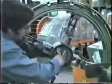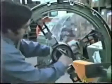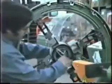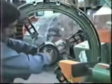The stator, now in our winding department, is having new slot insulation inserted. Before this, the winder took the data from the original windings and entered it into the computer on our automatic winding machine. You now see that winding machine in the background, automatically winding this full set of coils. These machines help decrease our customers' downtime by making the rewind process quicker and by improving the overall quality of the rewind.